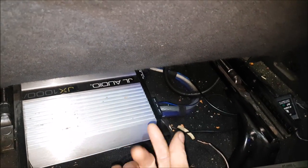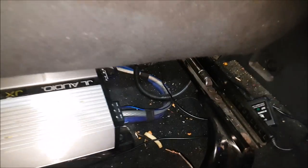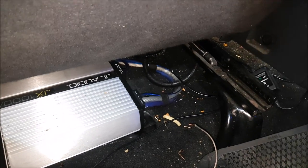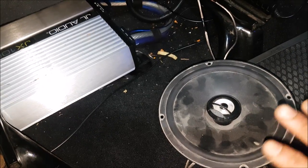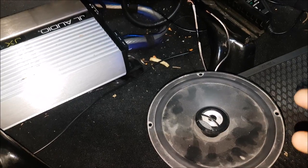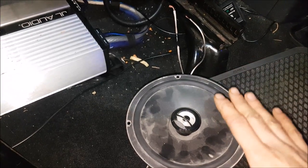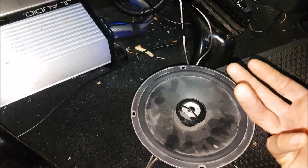Now that we know the amplifier is getting signal and it's turning on, and you've checked the voltage and everything, we can now check the speaker outputs. You can use your multimeter and check for AC voltage. Another quick way is to keep cheap speakers in the shop — speakers people want to throw away that are pretty much on their way out. That way if you attach one to an amplifier and blow it, you don't care. What you're looking for is: is the amplifier doing anything? A surefire way to tell is just hook up your test speaker and see if you get audio out of it.